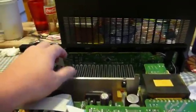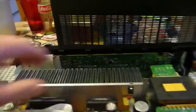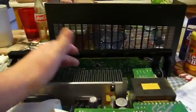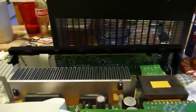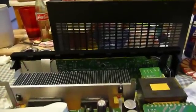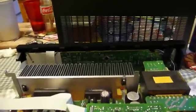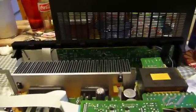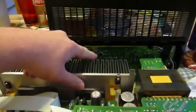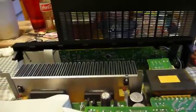Back to the display problem. I found a couple of suspect pins on the display and re-soldered them, but it really hadn't improved at all. So I started pressing on the board to try to determine the exact location of the fault, because I'd discovered that occasionally if I whopped the top of the unit it would come on for just a split second and then fade out again. What I found was not encouraging: when I touched the display controller chip right here, the display came back on and stayed on, but when I let go, the display went off again.